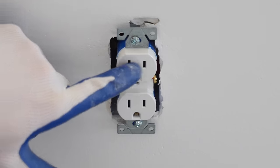Got that one started. Now I'm going to get the bottom one started. And now that we have it on here, we just tighten up the screws, and then that foam gasket's going to seal the water from coming in the back of this cover. And as you can see, you got a nice sturdy cover on here. Everything looks really nice and clean. And then to make this in use, just pull this tab out, and then a wire or a cord can come through, plug in while the cover is shut, to help keep everything powered while protecting it from the weather.